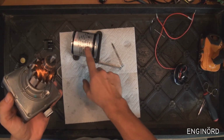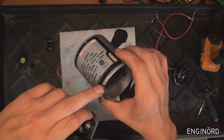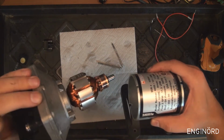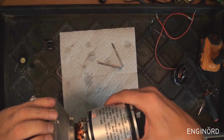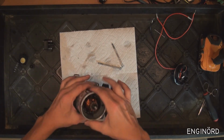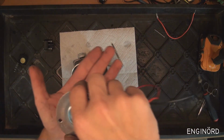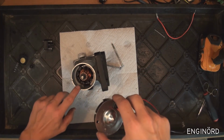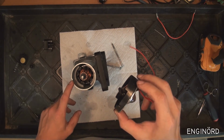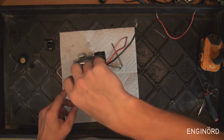When you're putting the motor housing on, you can see that it's keyed. So there's one notch here and one notch here. Okay, and there's a cast tab on this side, so you can put it either this way or that way. Then you've got to make sure it doesn't pinch your finger. Now when putting the commutator on, it's really important to put it in the right position, because if you clock the commutator relative to the poles here, that will change the timing of the motor. So take good care of putting this tab right there into this notch when you're putting it together.